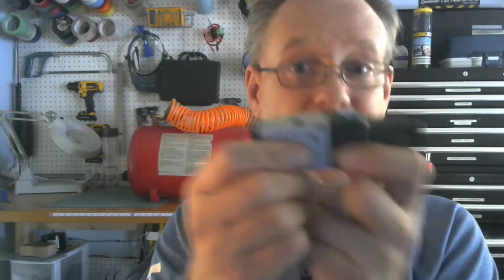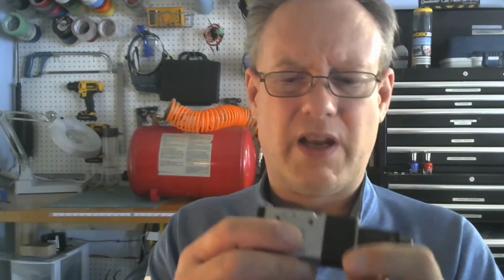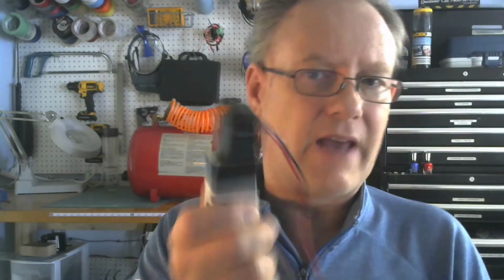The other thing is if this had two, I could go and order one of these that actually has two solenoids on it, and that would be a double solenoid DCV or a double solenoid 5-2 valve. You can also get a double solenoid 5-3 valve if you want. However that works, it's okay. I think you guys get it, that there's this little thing in here that's an electromagnet and it makes something move when we give an electrical impulse.